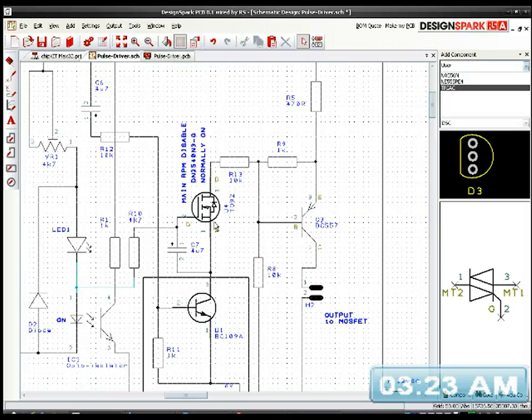Well, I hope it won't. If we've got a voltage coming through, a pulse, to normally turn this transistor on, this transistor will have to conduct downwards this way. I know that sometimes you put a voltage in the base and it comes out both the emitter and collector. So, I have to look at that. I might have to stick a diode, because it's got a diode in there, I don't want a signal going back the other way.